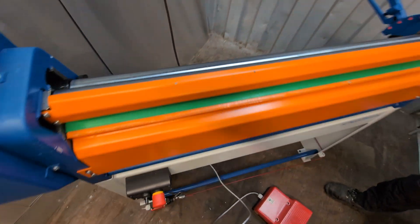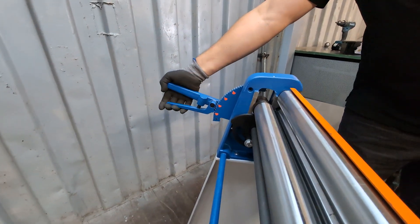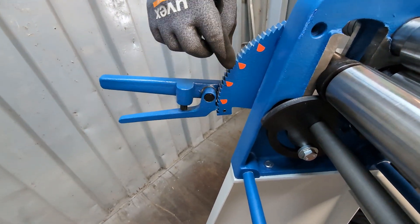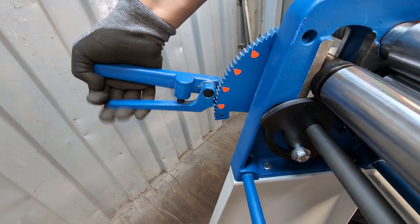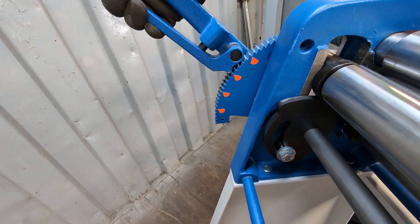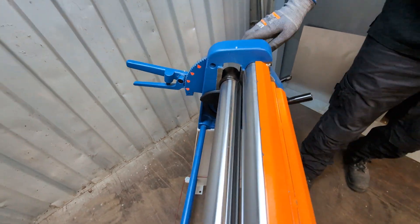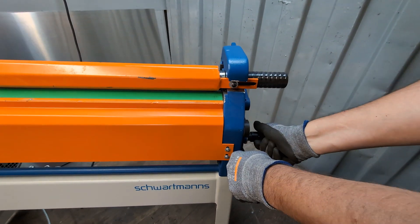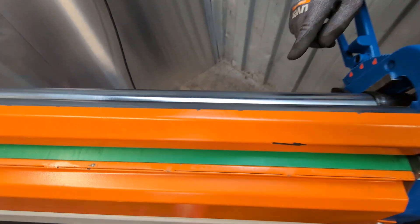On this machine there's a grip for changing the diameter — the higher it goes, the smaller the diameter. I've marked my distances on the seats: 5, 10, 15, 20, making it easier to go in between and memorize setups. There's also another grip on the other side for loosening.